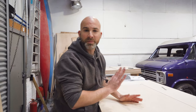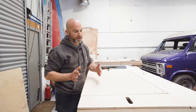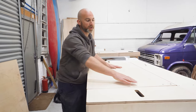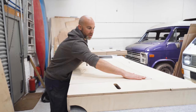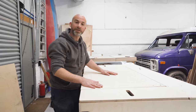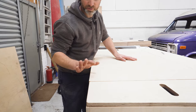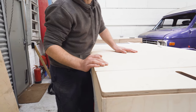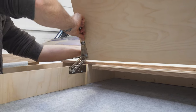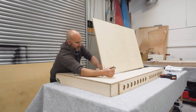And there's the box completely put together. The only thing left is to adjust the hinges — you can move the lid forwards and back on the top part of the hinge, and move the hinge up and down on the side nuts and bolts. Have a good fiddle around until you're completely happy with the fit. What I'm aiming for is to keep the front as flush as possible between the lids on top of the box. All this lid needed was just a slight adjustment to make the front edge flush, and I'm pretty happy with it.